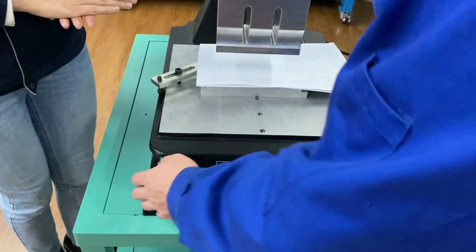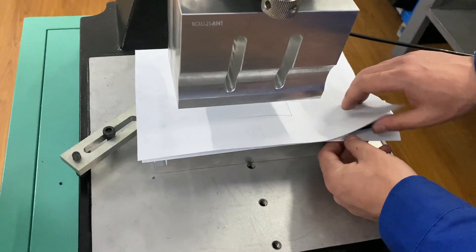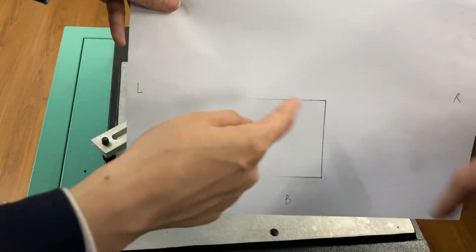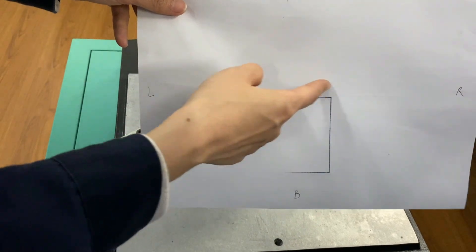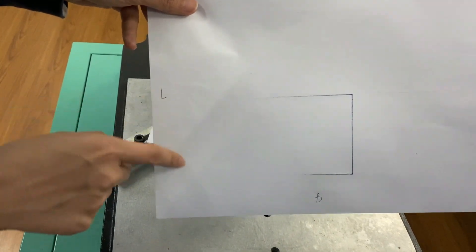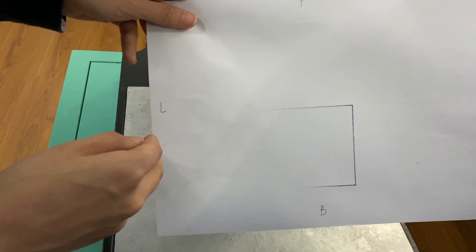So there are totally three layers. Flip the two green buttons so the upper horn goes down, then goes back up. Let's see the imprint on the paper. From this paper, we can see the upper horn should leave a rectangle mark. But one side has almost no mark, which means that side has too low pressure, so we should adjust it.